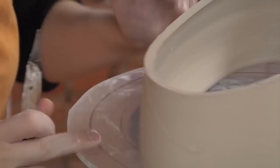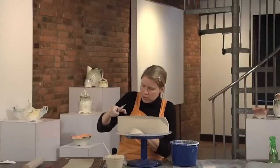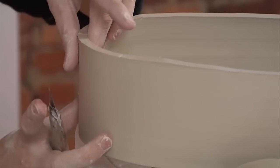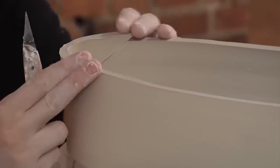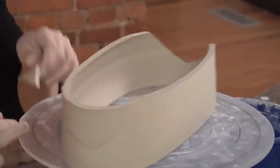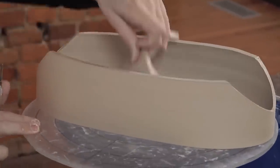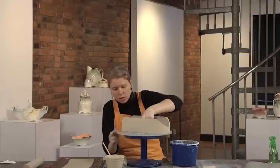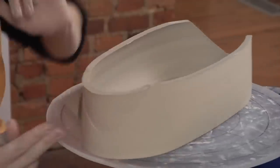I'll do the same thing at the other end of the piece, taking that same distance. To check that I cut the same amount out of both sides, I take the scrap piece from one end and fit it into the other end — it should fill the space. It looks like my second cut was a little bigger than the first, so I'll go back in and remove just a little bit more material until that piece fits in.